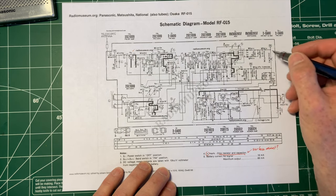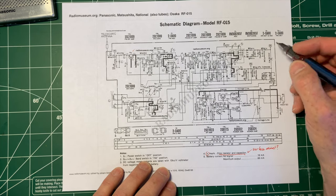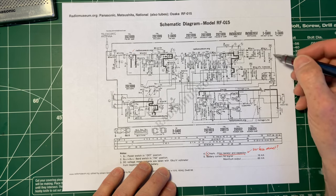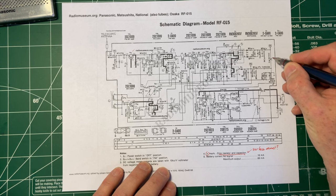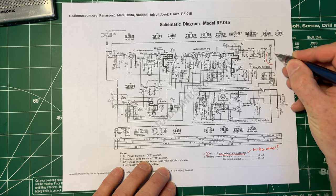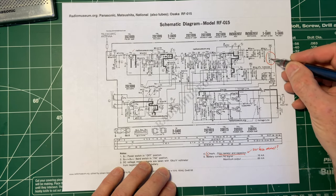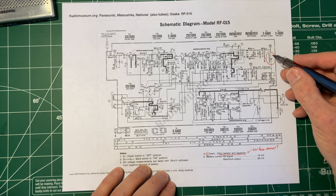So let's see where we can find some electrolytic capacitors. They're probably not going to be surface mount in this era, and we're also going to have plus and minus on them. Here's one here — capacitor 28, 16 volt, 0.22 microfarad. I've ordered that. So that's a possible target.